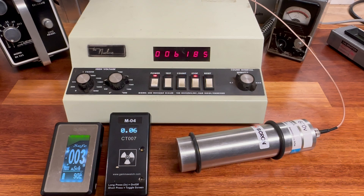Imagine having a scintillation crystal or detector system that accurately represents the same size of the human body with this efficiency. The amount of gammas impacting the human body at any given time is just huge. If you multiply that by every single minute you're walking around, we are walking in an absolute roiling ocean of radiation at any given time — and this is here in the shop where we have extremely low background radiation levels, constantly between 0.06 and 0.08 microsieverts per hour.